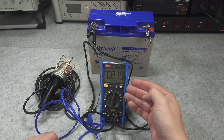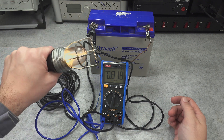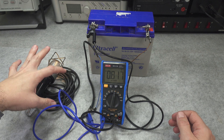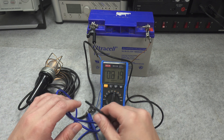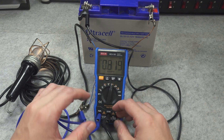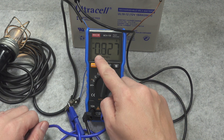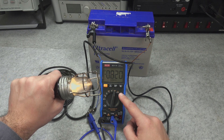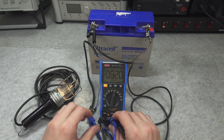So from a technical point of view, if that were our Victron Energy lynx it would think we are recharging our battery with 0.8 amps going toward the battery — but that is clearly wrong because we are actually using power. If I attached a charger it would think we were discharging. So to fix the issue it is extremely simple: on our shunt resistor we reverse the connections, and as you can see we now get a negative value. If that were the lynx, it would correctly see that we are using power. It's that simple — just a tiny reverse to correct it.